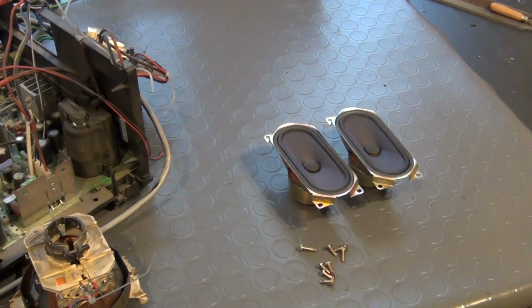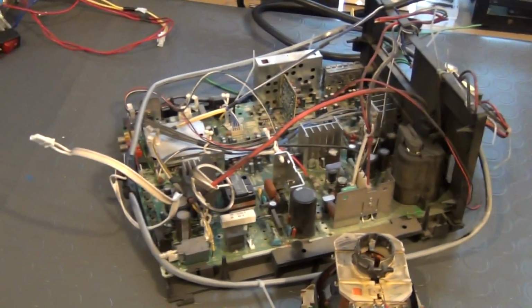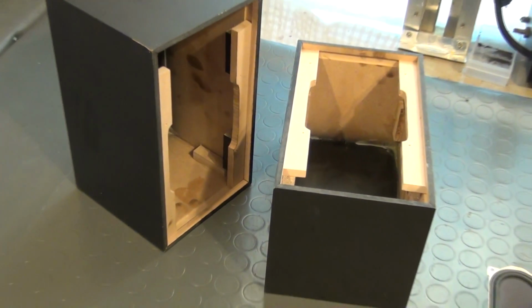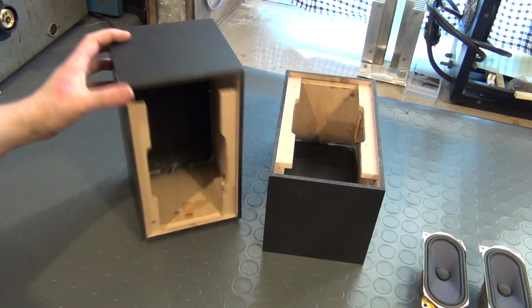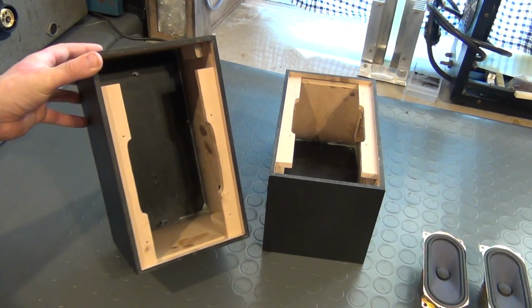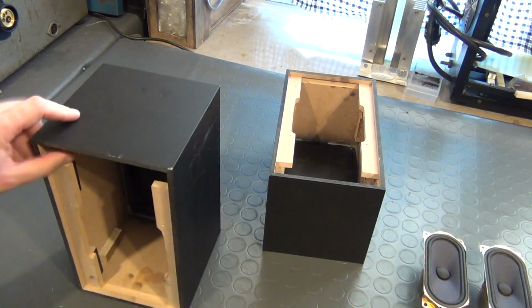They are 8 ohms speakers, which is less than ideal for a car stereo system. Since car stereos run on only 12 volts, you usually use loudspeakers with a lower resistance value in order to achieve more output power. But here at my channel, we work with what we have, and these loudspeakers will suffice for our purposes. Furthermore, we will use these wooden boxes here, which I picked up from the trash years ago. I always knew I would use them one day.